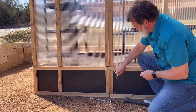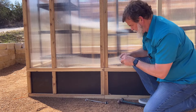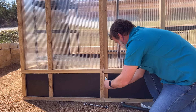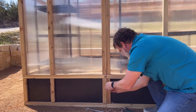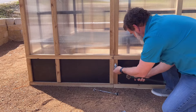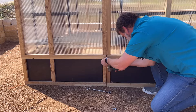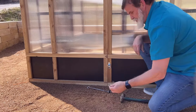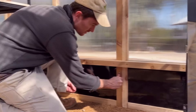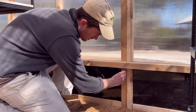The way these D-rings work: we've drilled the holes so that this device that captures the D-ring goes in, and we provide quarter-inch bolts. The D-rings get bolted all the way through so they'll be strong — all the way through to the inside of the greenhouse. On the back side we put T-nuts on; the T-nuts are self-locking and allow us to tighten the front of the bolts. The T-nuts go on the back side of the bolts that came through, and you just hand-tighten them. It's probably best to use two people to do this.